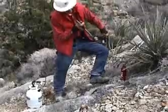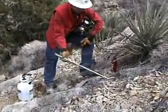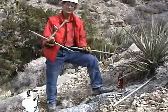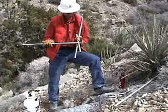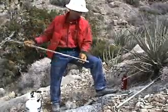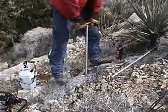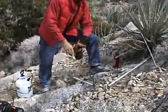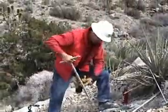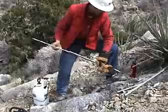Okay, I'm going to check the core barrel. It looks like we have some material in there, and the bayonet connection is just the cat's meow. There's a nice long piece of core. I'm going to try to extract the core still down in the bottom of the hole, and for that we use this stainless steel T-handle. It fits on quick and easy with the bayonet connection using a regular two-foot drill extension — and because I'm tall, I'll use two of them. There's a little cam lever that pinches onto the core to allow retrieval once you get over it. We've got a little bit of core in the hole, and I'm using this core puller to gently lift it out. There it is — our little bent finger has caught it, and you just dump it out like so.